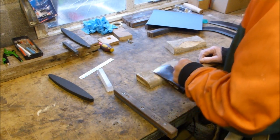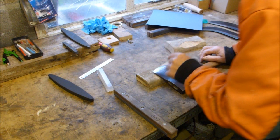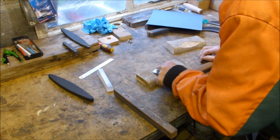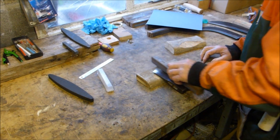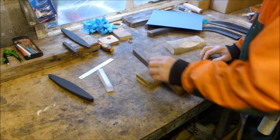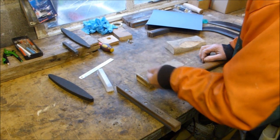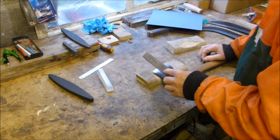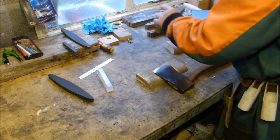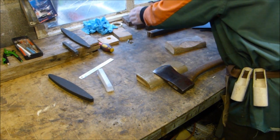And then what you can do then, if you get an eyeglass, if you want to, is you look, and if the new marks caused by this file, which is finer because of the finer grit, are wiping out the previous grinding marks, there's no need to go any further with that because it's achieved its purpose. Then you go from 600, I've got the next one, there's 1,000 grit.